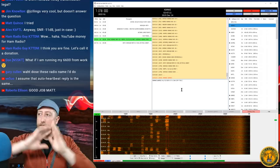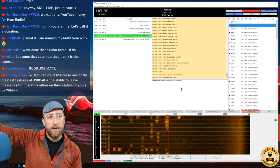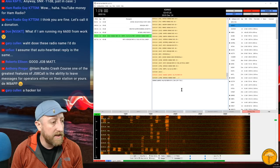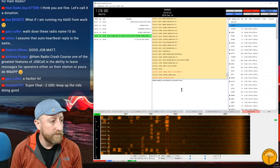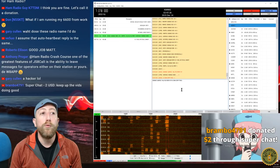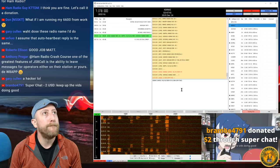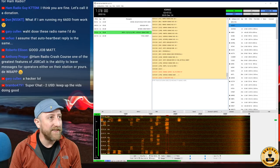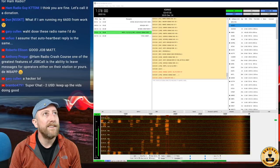I'm transmitting easterly from my home station antenna. We'll see if people are copying me. While waiting — question from chat: is JS8Call a radio chat room? Kind of, but it's more than that — you can send messages, relay traffic, send messages to an inbox for later download, and transmit an APRS beacon. Lots of people are replying that they can copy me — 'How copy, endpoint' — endpoint is good, meaning they received the whole message.